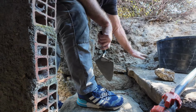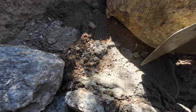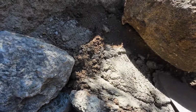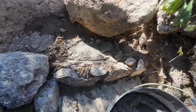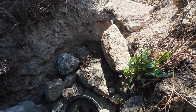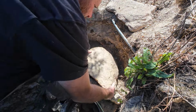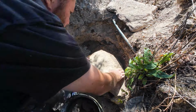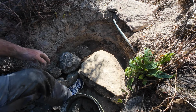It's not too bad to get another one over the top of that. So what I found now, just trying to get this step in a bit more secure, is under here is concrete as well. So I put a little bed of mortar on, just to bed this one onto, and I've built up a little wall, like the front of the step there. So if I just put you there for a sec, something like that, I'll try and nestle this one into it because it's got an angle on the front. I quite like that. Maybe a bit more back there.